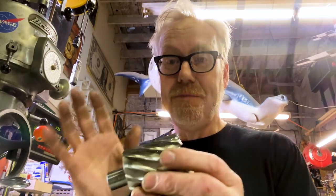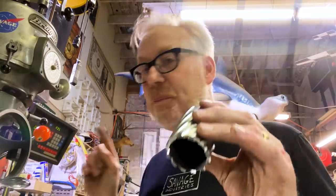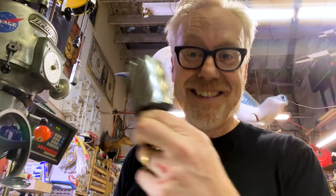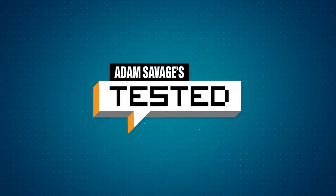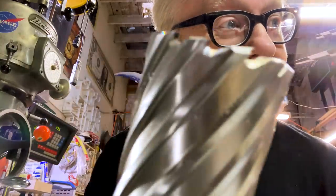I hope yours will be too. As always with every new piece of equipment, read as much as you can about it. Be careful. Go slow. Use lots of cooling fluid — all the normal caveats apply. Making holes is one of the most common and frequently one of the more difficult things I do, depending on the size, location, and material. Annular cutters — these aren't for handheld drilling, really not, and not even really for a drill press. I need the precision of a mill to utilize these. But when I have it, oh man, what possibilities these open up. Thank you, John. And thanks, you guys, for watching — I will see you next time.